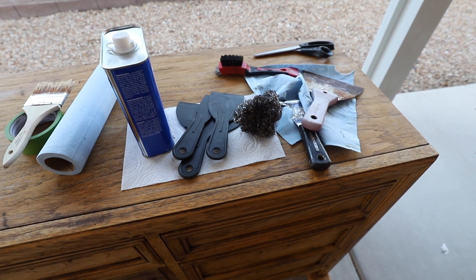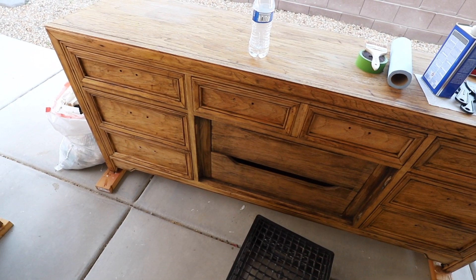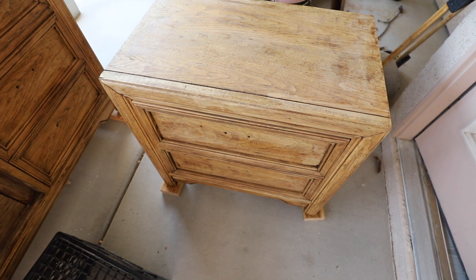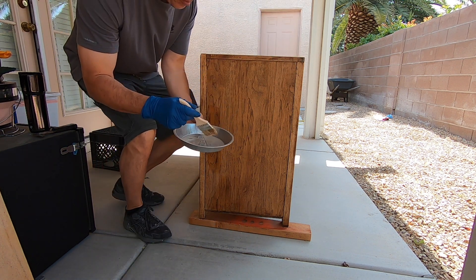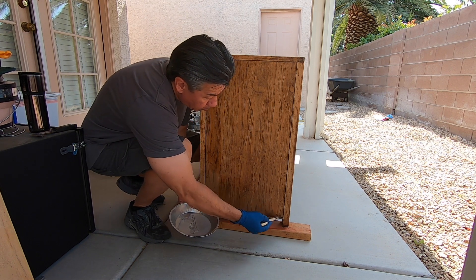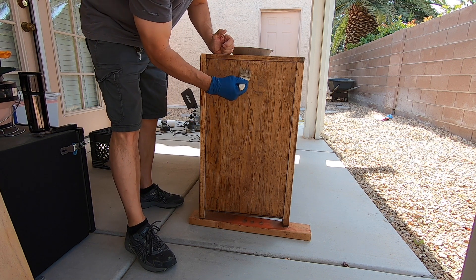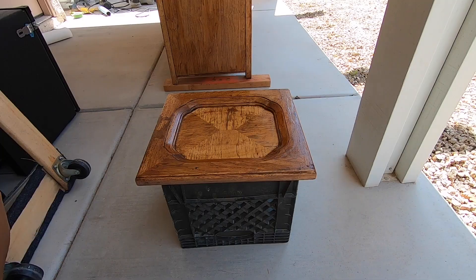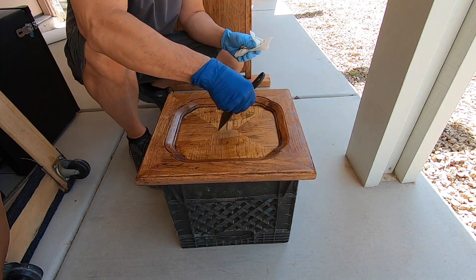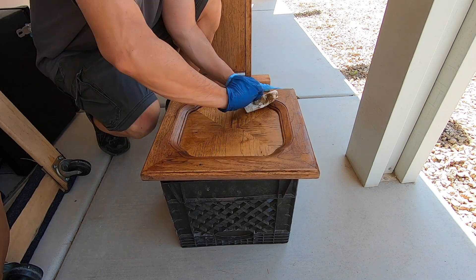Here I have the tools of the trade — the brush, both plastic and metal scrapers, a hard-bristled brush, and a different type of stripper called Clean Strip I also wanted to try. I've got most of the finish off, and I'm going over the stubborn parts as well. I'm not going to sugarcoat this — it's a very long, tedious, messy process. You have to wear safety equipment: at least one glove, two when actively stripping. I go through a roll or two of paper towels. The Citrus Strip residue has the consistency of tar.